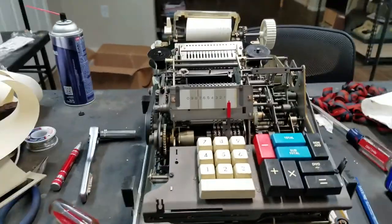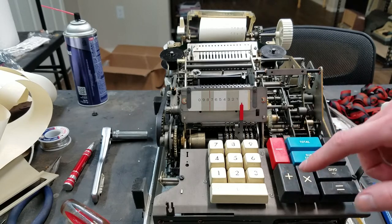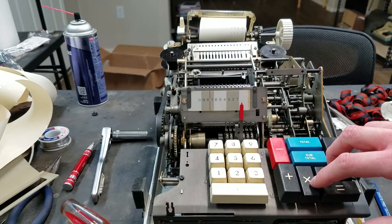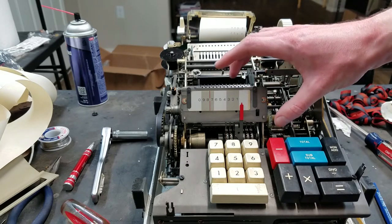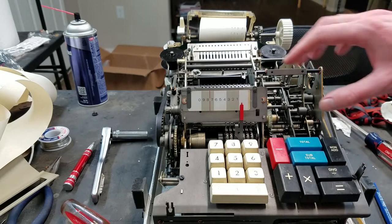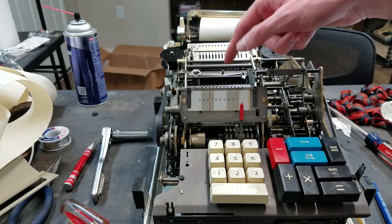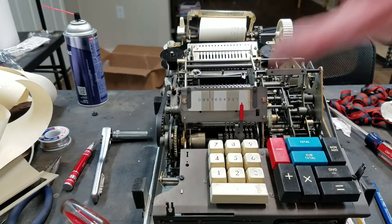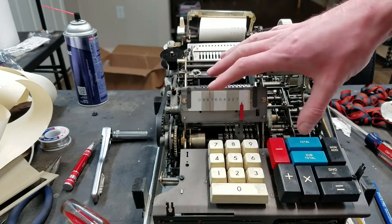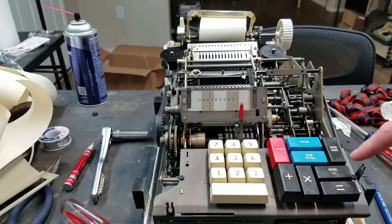this machine seems to be basically like two separate machines put together, where the addition, subtraction, total, and subtotal parts are basically a reciprocating machine, and then the multiplication and division parts add in a rotary machine on top of that. So the reciprocating machine can operate independently of the rotary machine. Whenever you're doing addition and subtraction, the rotary part, which is the pinwheel cylinder here, the carry drum behind it, and I think the register for that is right underneath, I'm not exactly sure, that part doesn't get involved, as far as I can tell. So the dog clutch here stays disengaged, or is supposed to stay disengaged, unless you're doing a multiplication or division, as far as I can tell.